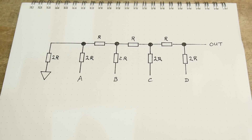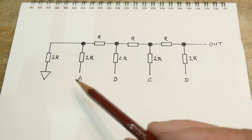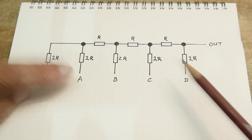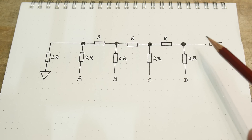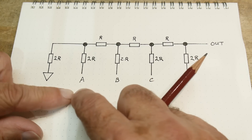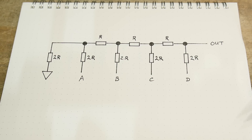So what is this thing? It's sort of a poor man's digital-to-analog converter. You have four voltages here, and we can say there's basically anywhere from zero volts to 10 volts. The way it's normally used, you can think of these as analog ones and zeros — it's either zero volts or 10 volts, but not in between. So it's either zero or 10 on each input, and then you will get something on the output.